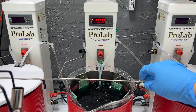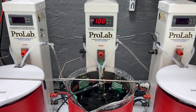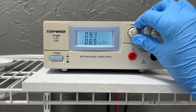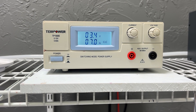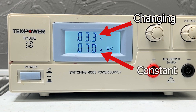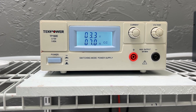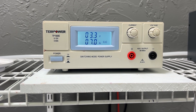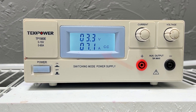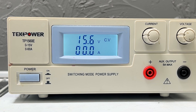I'm going to put my item into the solution and then slowly turn up the current knob to match the amperes I need to plate my item with. As you can see I am pulling about seven amps, and you'll notice that the power supply automatically adjusts the voltage to fit the needs of the current. This will differ when plating onto smaller items with less surface area as well as items with larger surface areas. Now as I take the item out of the solution you can see that the amperage will drop back down close to zero.